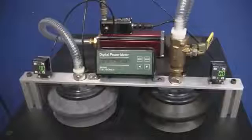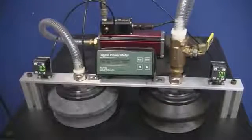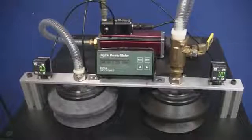But actually what's shown here is the horsepower output of the pump, or the brake horsepower. The energy that's required to operate the pump isn't given, but needs to be measured to be accurate. This demonstration uses a watt meter to monitor the electrical usage of the pump. Now we also know that mechanical pumps are not designed to turn on and off as they operate.